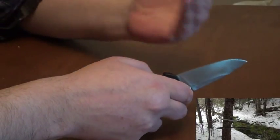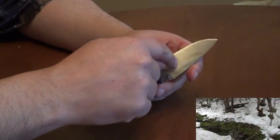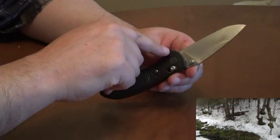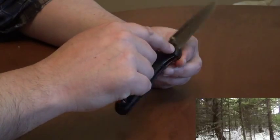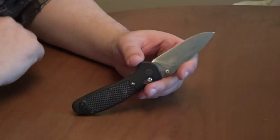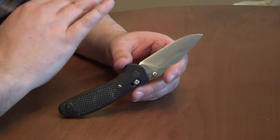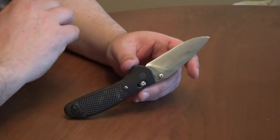Going back to seven years ago — how come the performance was so bad back then? Because they burnt the steel at the edge. You can see how significant the wear is: this sharpening trial notch is much smaller now than it used to be. A significant amount of metal has been removed. So all the weakened metal from the initial burning is now gone, and I think in retrospect that was probably the reason for most of those early reports of S30V having really poor performance.